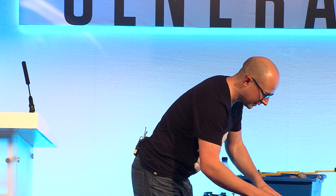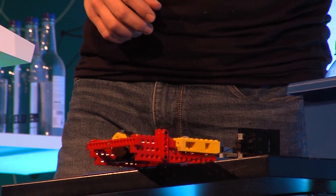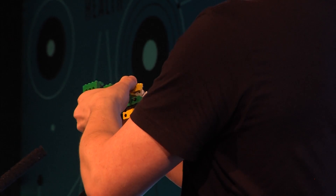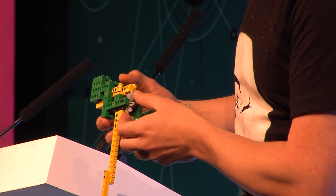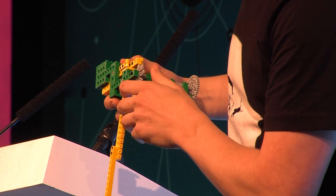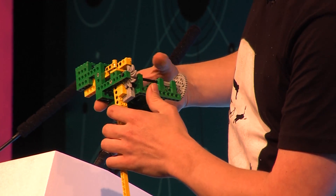The next problem is we need to get that energy somehow into the pendulum to keep it ticking. To do that, we come to the most confusing-looking part of the clock, called the escapement. Now it looks a bit weird, but this is another thing that's great to explore with Lego, because when you work with it with your hands, you'll see it's actually quite simple. What we've got here is a beam on top that can move up and down, a gear which has spiked teeth called the escapement gear, and little blocks stuck on the pendulum which interact with the beam and the gear.